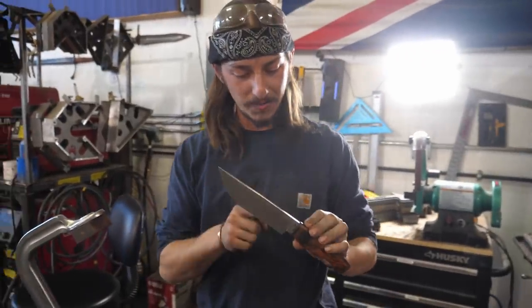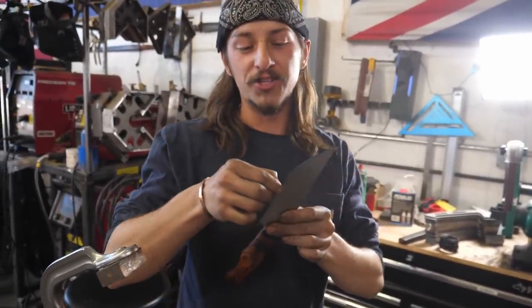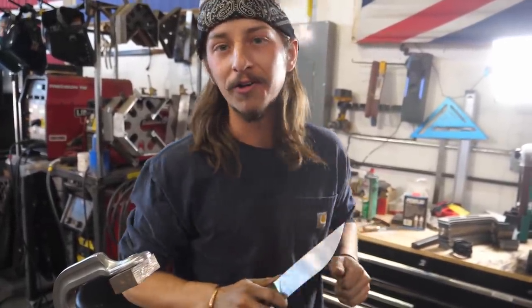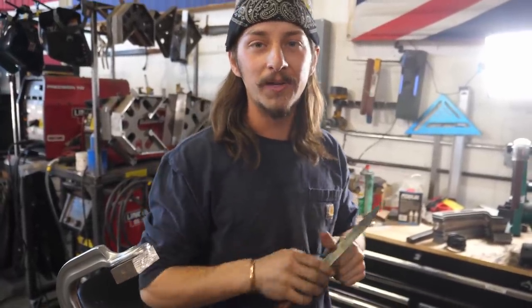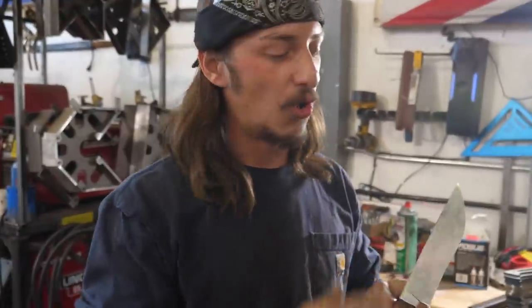The epoxy should be set. I'm going to head back into the grinding room just for a little bit — I'll take a 400 grit belt to break in the initial edge and then sharpen it on the WorkSharp grinder. You can use stones or whatever you've got at home to sharpen; this is just the way I like to do it here. As soon as it's sharpened, I'm going to give the whole thing a coat of Axe Wax and then it's good to go — ready to chop some stuff.